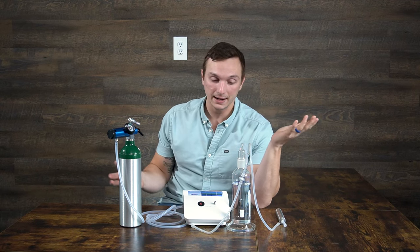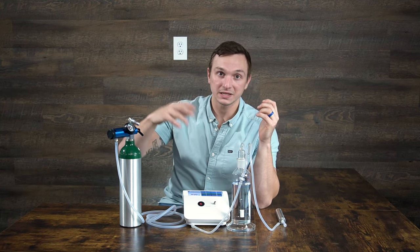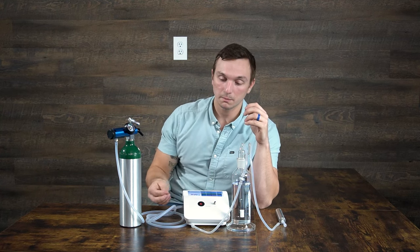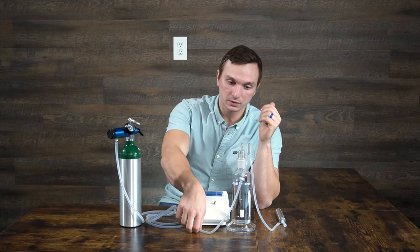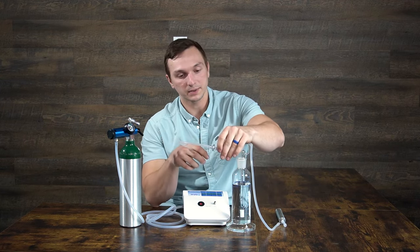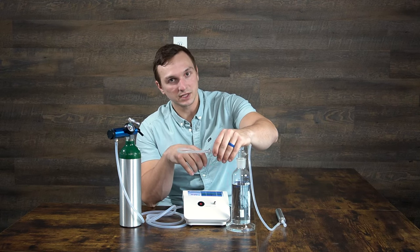It's super important to disconnect it every single time, because with the nature of these oxygen tanks and regulators, once you send them to zero they create some suction which will pull through the ozone generator and can lead to water backing up into your machine — or oil, if you're using oil. This disc protects it from that.